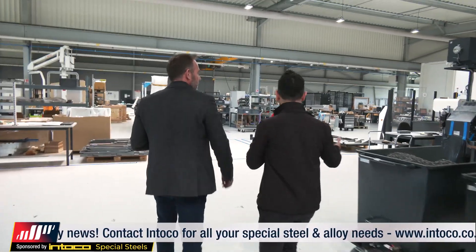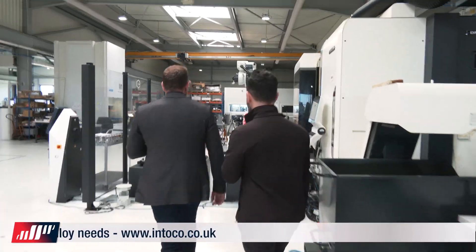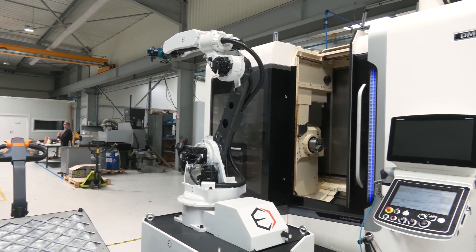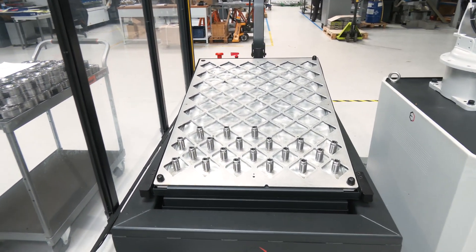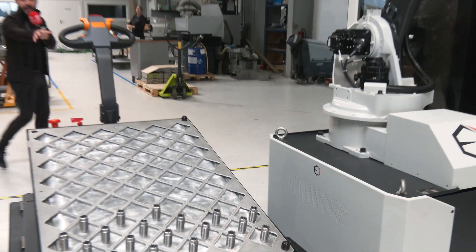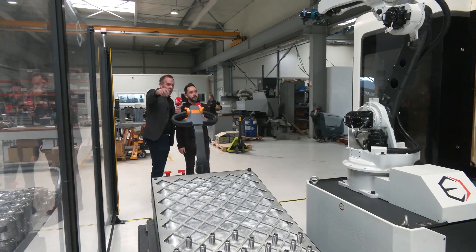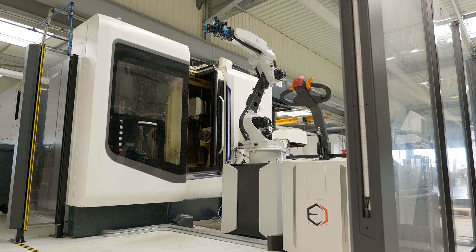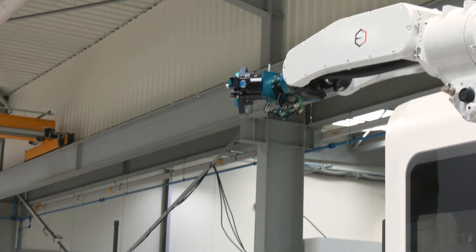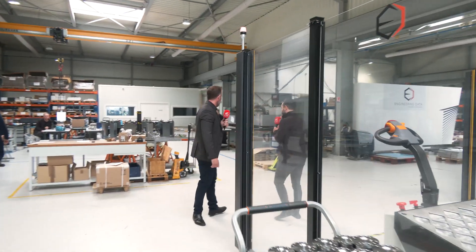They've got many solutions. Now we're going to look at another solution, which is part of the Easy Prod range. The Easy Prod range is designed for CNC lathes. As you can see here, we've got a six-axis robot. You can load your billets into a pallet system and the robot will pick and place your parts. This pick-and-place option works in conjunction with the zero point — it'll pick your parts and place them into the chuck, the chuck will grip it, and away you go. On this particular application, they're actually making parts for their zero point fixtures — making the easy plugs right here.